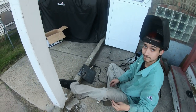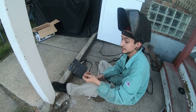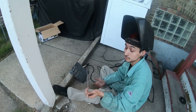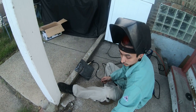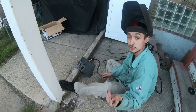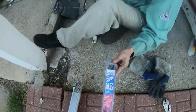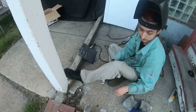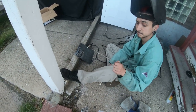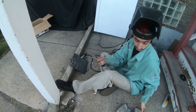How do you think this welder welds? For small house projects, it's actually pretty good. I find that the 1/16 inch rods, even with this, are just a little too hard to strike up — kind of stick. The 5/64 inch 6013 rods do strike up a little better. These are by US Forge, got these at Menard's, about 6 or 7 bucks for a 1-pound pack. The 1/16 inch ones I got from Harbor Freight, and I really don't care for them much. But these ones strike up pretty easy.